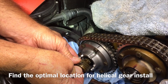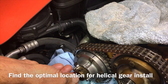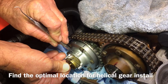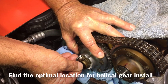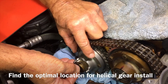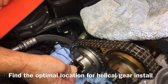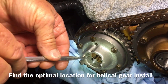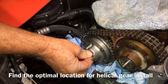I've made some marks to show you how to find the sweet spot. You can see this black mark right here on the helically-cut gear — it's going to mate into here. Watch as we move this hub very little to make it go in. I'll do it again — it's very slight. I take my fingers and move this hub just a little bit and there it is, and it goes all the way in. You can see how much travel we get — a lot of depth and a lot of movement on this cam gear.